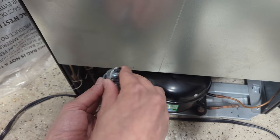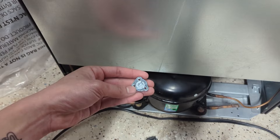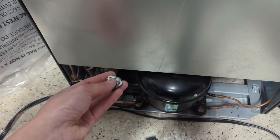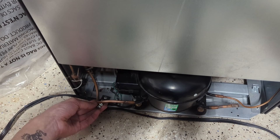Once the valve is apart, it separates into two halves. This side has a gasket and a small hole — set that aside. This piece is the one we care about. Take the properly sized insert and snap it right in there. Now we have to find a place to put this. I've decided to put my valve right here where there is a straight section.